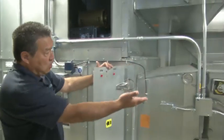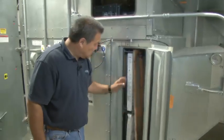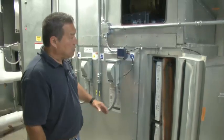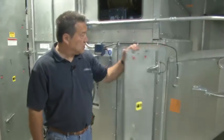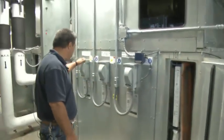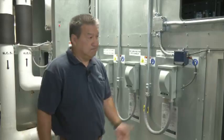Fresh air in has to go through this set of filters here — make sure they're clean to keep that heat wheel clean. Two-inch pleated filters go through here and through the heat wheel. Another important feature of this machine is two-inch thick foam walls with all gasketed doors to seal it and keep the heating or cooling inside. The engineer spec'd out three different disconnects, one for each motor: heat wheel, return air fan, and supply fan.